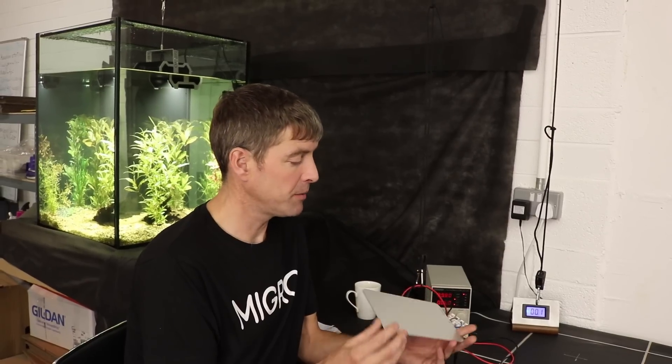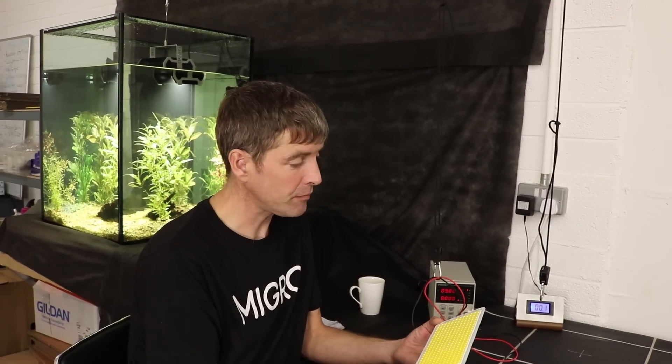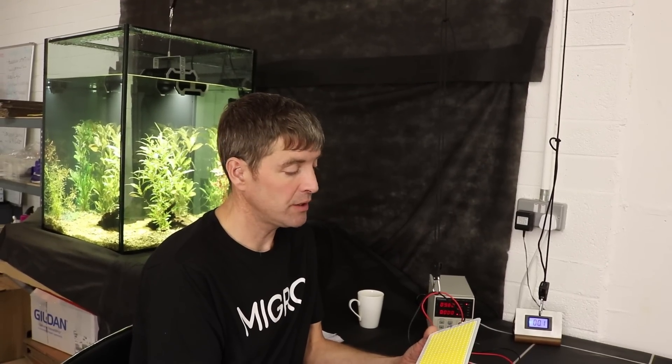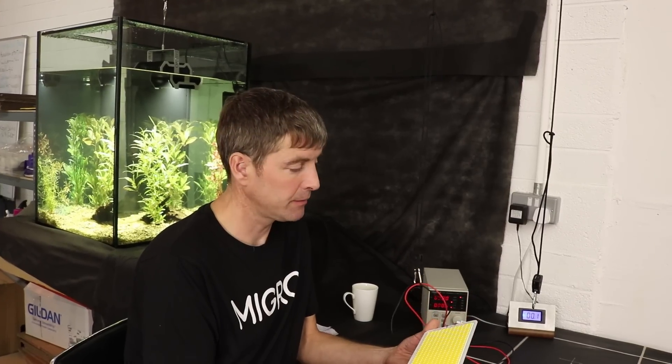You might want to buy them and try them out. If you have small 20 or 30 watt, 12 volt power supplies — a 12 volt supply limited to two amps — it would work fantastic with this as a small seedling light; you wouldn't need any forced cooling. Fun little light to test. Hope you enjoyed. Please leave your comments and take care. Cheers.